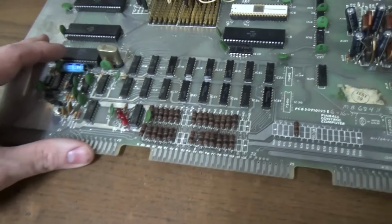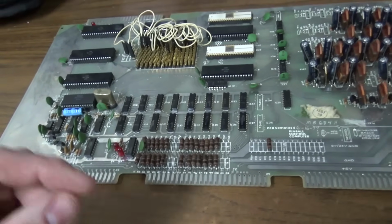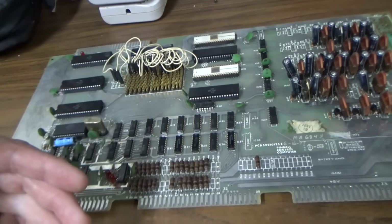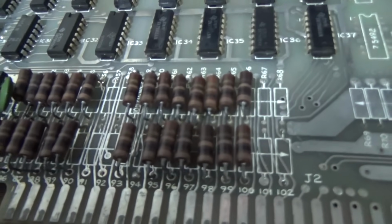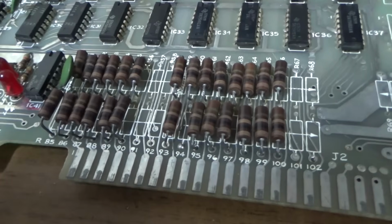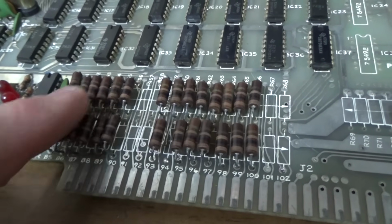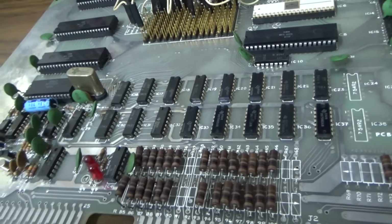So on those boards, like I said, it's a little bit taller, and in this area there are some diodes to protect some of those lines, the thought being, if a voltage goes down that line, it can't get back to the chip. The diode will stop it, right? Now, these resistors, as I understand, are stay-on resistors or something like that. The resistors basically keep the lamps heated up so that they can quickly turn on and off. John recommends taking these all off and replacing them with diodes because that way it will protect if voltage comes back down one of the lamp lines.